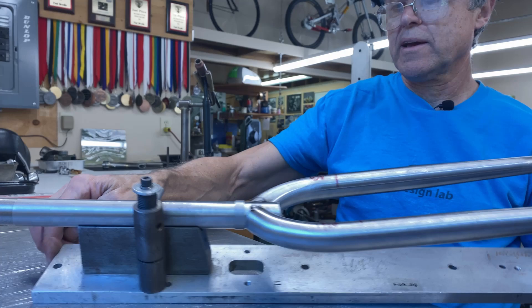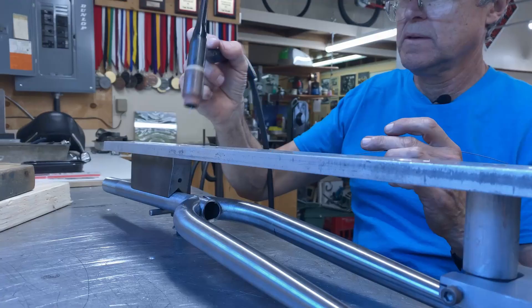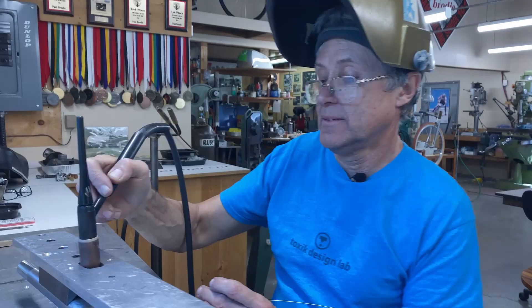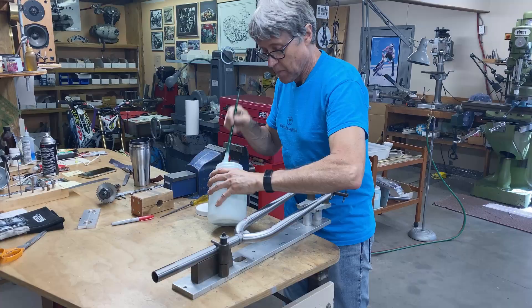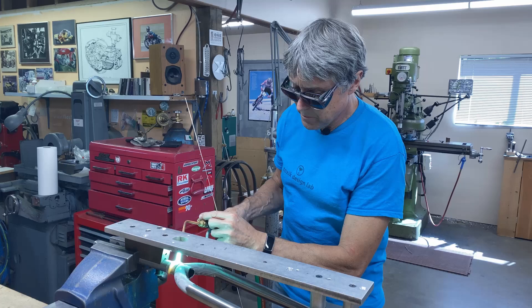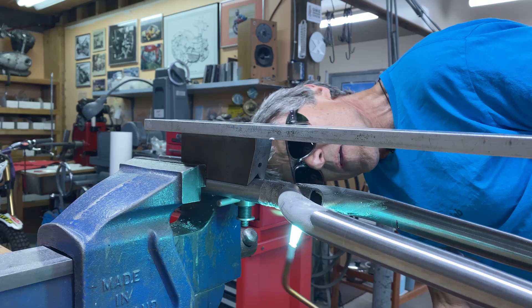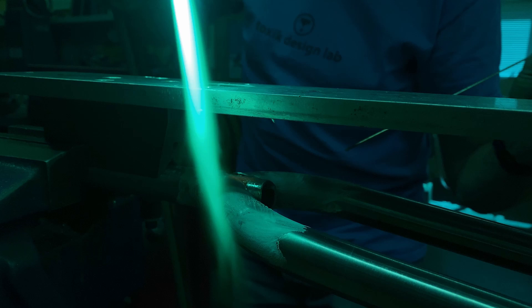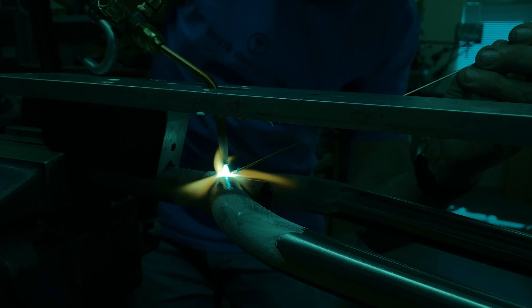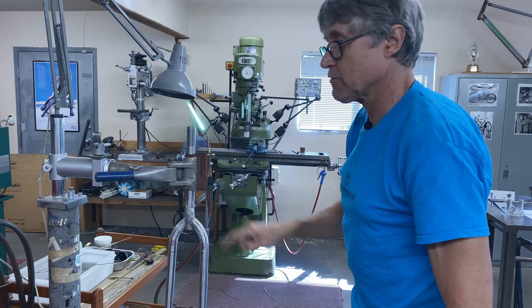We'll see what happens on the back. This hole here — I used to use that for the brazing torch so I could put the torch through there. It's a no-go, it's an awkward angle. So I'm going to tack it with the oxy-acetylene. I'll do a little bit of preheat first, just to get everything up to temperature. It takes longer for this and the steer tube to get up to temperature than the blades — that's pretty normal because it's a thicker tube.